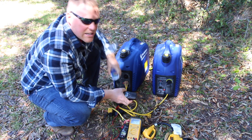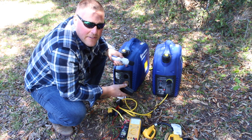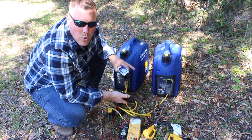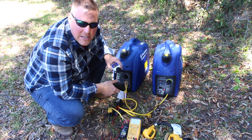I'm going to have her engage the 15,000 BTU air conditioner on high fan with the AC running. You're going to see a short voltage drop — that's just the fan running. It should read about 4 amps while that's running, and then we'll hear the power kick up once that compressor engages.